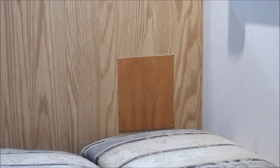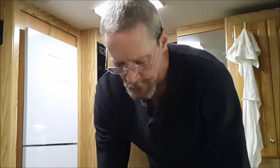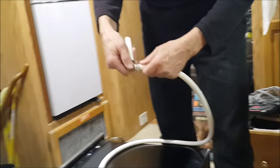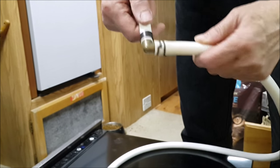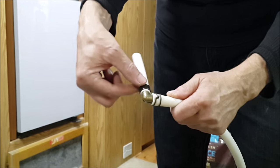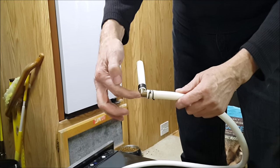So this is what's been holding this up all this time — the water line. This hose has been wired on there with mechanics wire, as you can see. It won't turn, won't move, nothing. And then it's been crimped here because this is actual PEX and this other piece is not — it's a lot thicker wall — so it won't go on a PEX fitting.